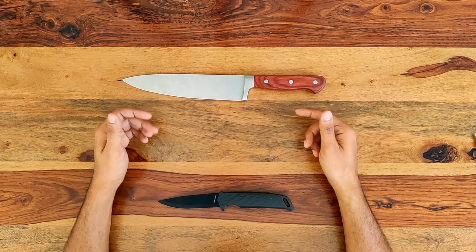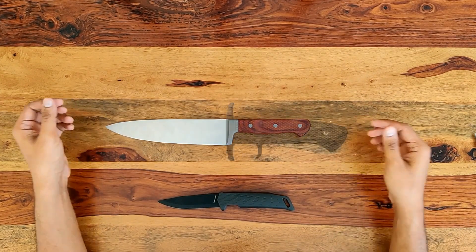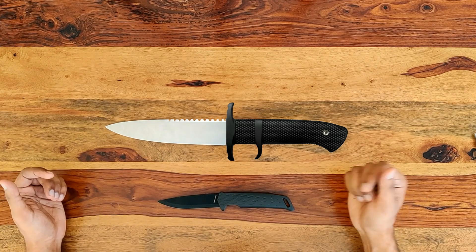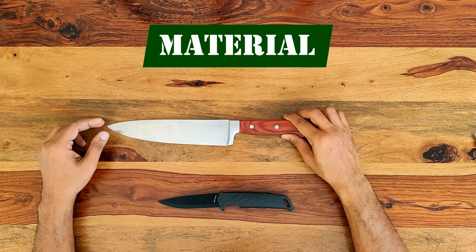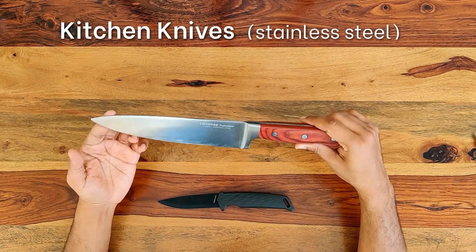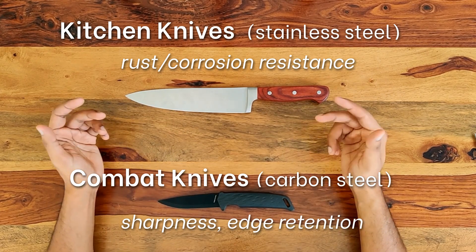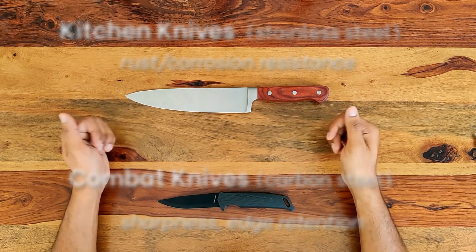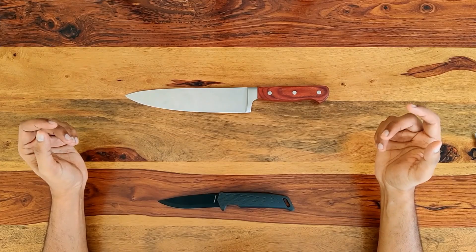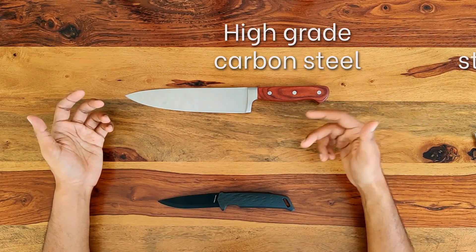But we've been talking about handles. What about the blades themselves? Say you take this kitchen knife blade, remove its handle, and put in a badass-looking tactical handle in black — would that make it a combat knife? No, it's not that simple. Not even if you cut serrations and give it a combat knife shape, because the material is wrong. That brings us to the second factor: blade material. Just like the form, the material is also decided by the function and purpose. Kitchen knives are mostly made of stainless steel for rust and corrosion resistance, and combat knives out of carbon steel for sharpness and edge retention. This kind of used to be the rule, but with advances in metallurgy the lines are getting blurred. When we say stainless steel and carbon steel, it's not just two materials — it's a whole family of materials, several subtypes. Which is why most carbon steel versus stainless steel videos on YouTube don't make sense: you can't pitch a very high-grade carbon steel against a cheap stainless steel and declare that carbon is better.